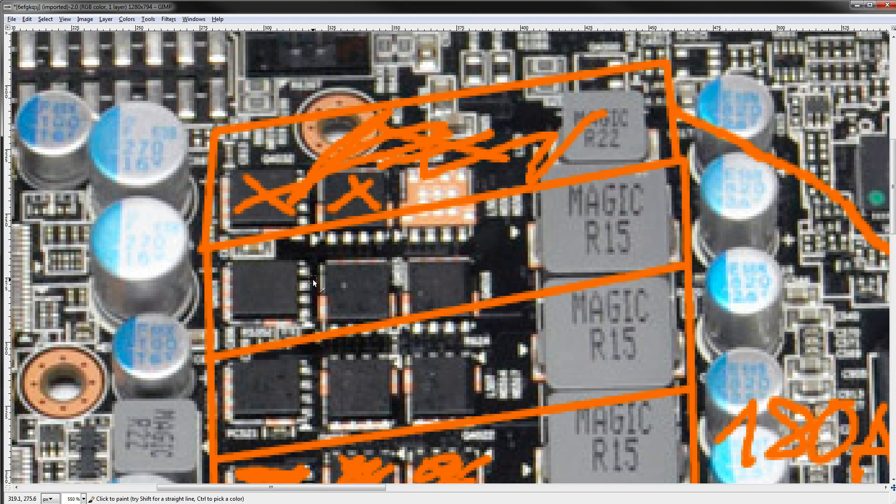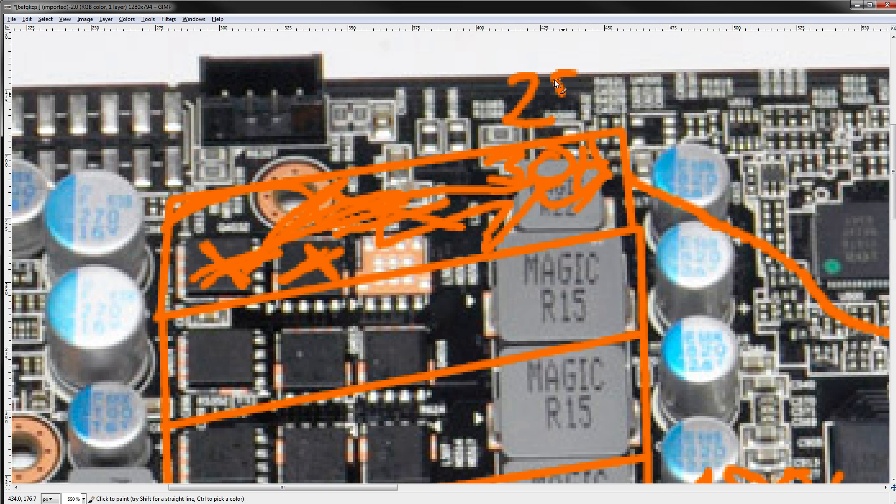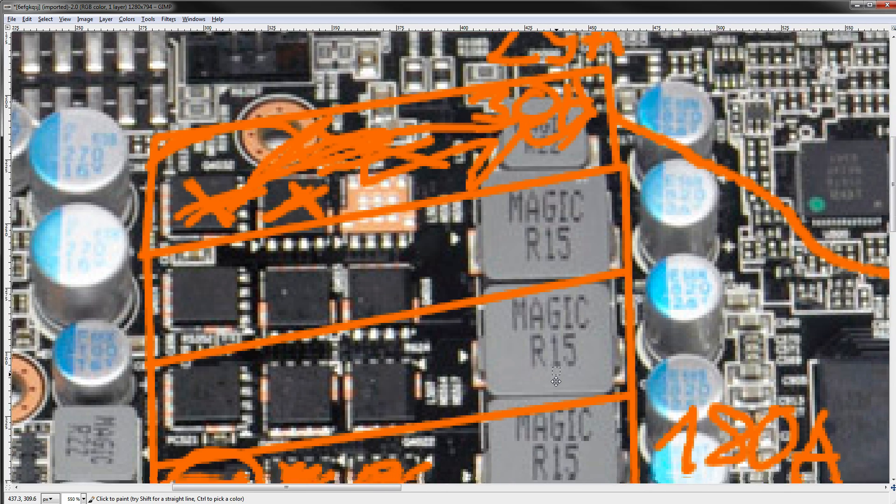For the auxiliary VRM, I'm not sure what MOSFETs are actually used here. I think it's the same MOSFET as the high-side for the core voltage, used twice, so this should be at least 30 amps. Either way, it would be fine because the auxiliary rail is really low power — it doesn't deliver a huge amount. The GDDR5 chips might pull 20 to 30 watts total, V-core on an RX 480 pulls around 110 watts or more, and auxiliary just sits there pushing about 10 to 20 watts. With a 25 or 30 amp rating, you're completely safe.